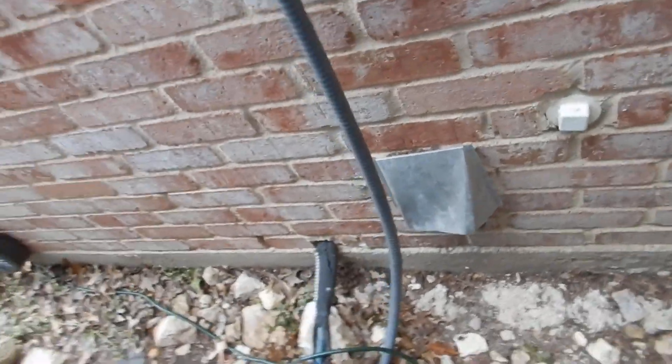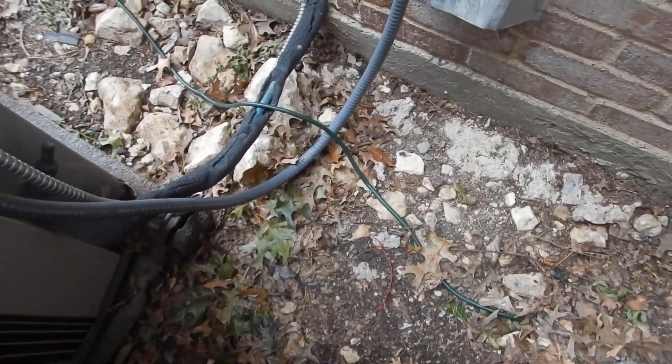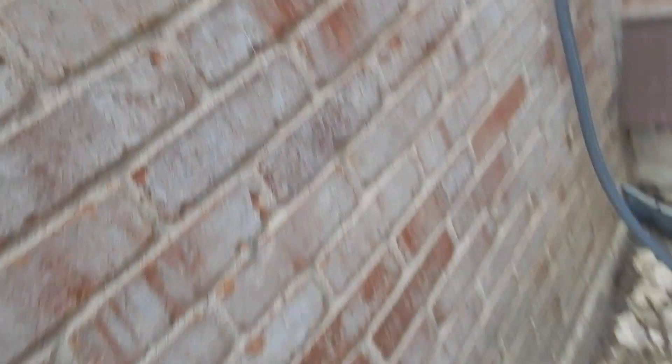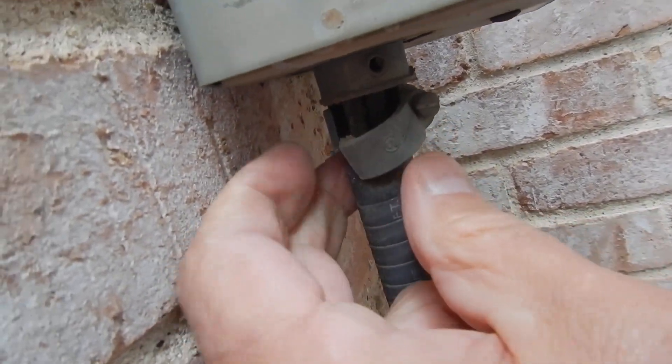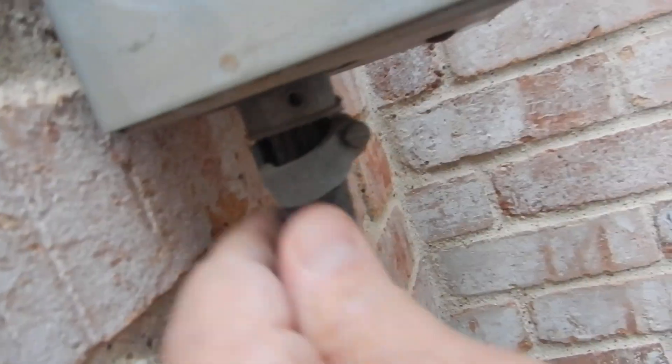There's also a clothes dryer that's too close to your air conditioning systems. When it's running, lint is going to come out and get stuck up in the units — and that's pretty nasty. Also, the conduit over here is kind of loose — the clamp is broken and doesn't work. That's how you get electrocuted. Don't touch it.